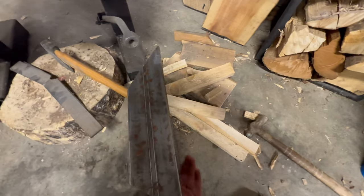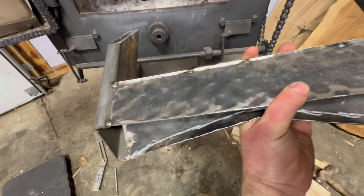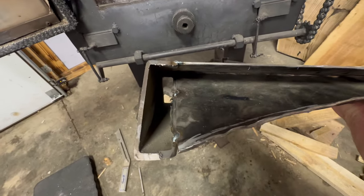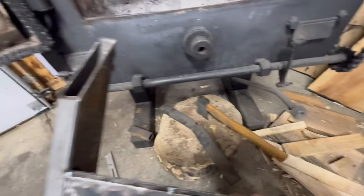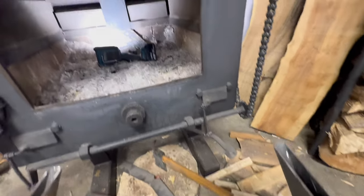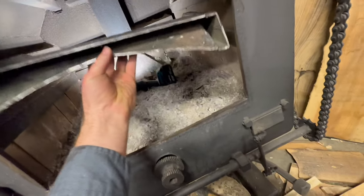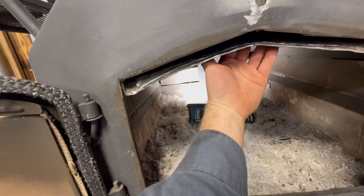Tube, and I cut a little triangle notch on each side and then have this 1/8 inch plate connecting it, making this separate chamber. And in those holes on each side, it's gonna go up like this, and on that angle cut, I still gotta cut holes, which is gonna be hard, but I think I can do it. I'm gonna cut a slot right there on that tube and right there. And that's where those are gonna tie in, sucking in air with the rest of that secondary burn. Kind of hard to show you, but it's gonna go like this. So something like that.